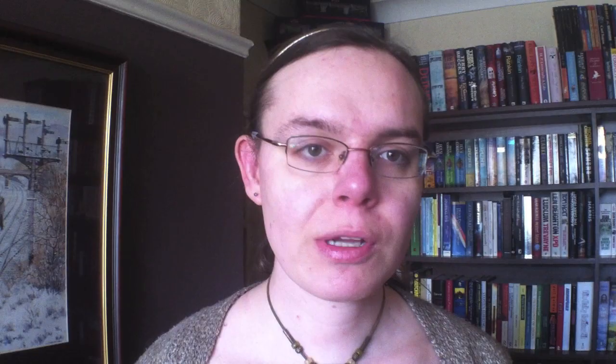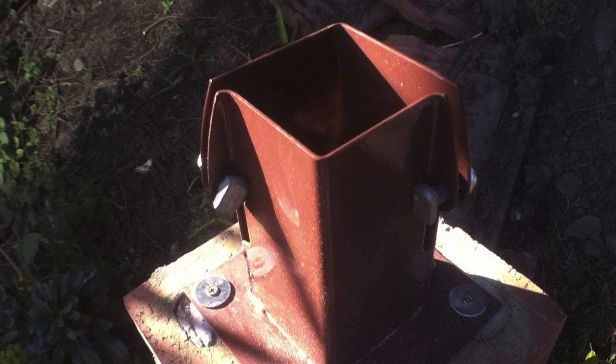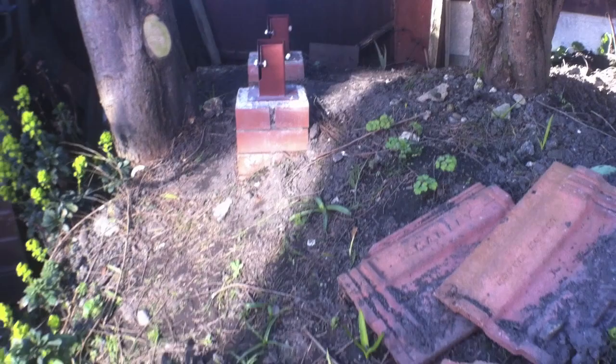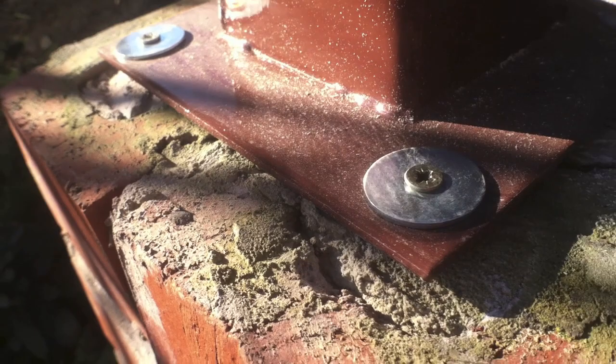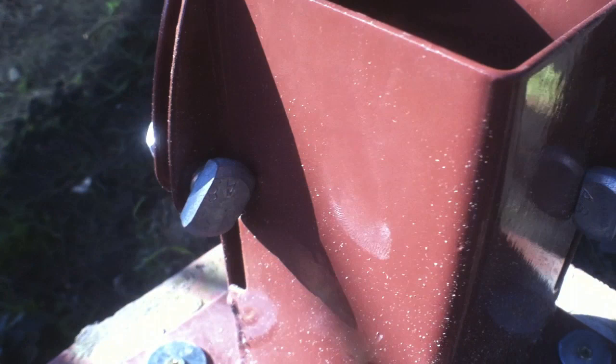What we've done now is drilled and screwed all of the metal base plates in place — all six are done. We've used washers and screws which screw into plastic rawl plugs, which in turn go into the holes that we've drilled. As my father always said, have the right tool for the job and it makes it a heck of a lot easier. In this case we've used a mains-powered electric drill with a 6mm masonry drill bit, with the hammer setting — which is very important when drilling into walls, concrete, or brick piers like this. It effectively slams the drill bit backwards and forwards very quickly and slightly, helping it get through materials such as cement. These are now all ready and fixed, waiting for the wooden posts which will support the actual track bed.